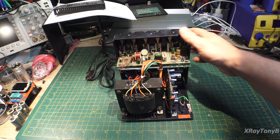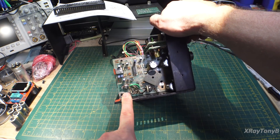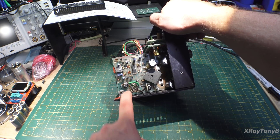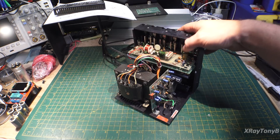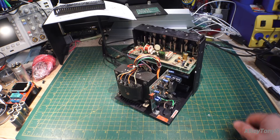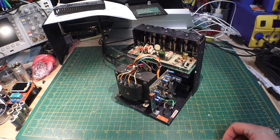We're not ready to power this thing up yet. One of the reasons is we are missing two components. The first is we need the new triac — I had to order one, I didn't have any in stock that would fit. And the two big capacitors — although they tested out okay unlike all the other caps — I decided to replace them. I found some rated at the same capacity but 100 volts instead of 80 volts, so they'll be a lot more stable.